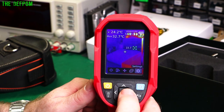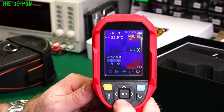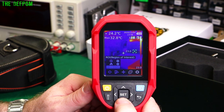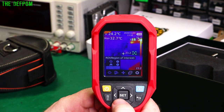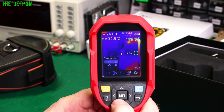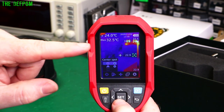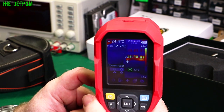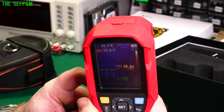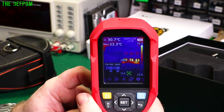With the center spot turned on I can focus on something — for example, pointing at the clock up here it tells me that temperature. It's really about 30 to 31 degrees C up there, around 30.7. Then there are color palettes — you have about 7 palettes to choose from. I quite like the iron palette, which is probably the best for average temperature scaling as it gives a bit more sensitivity in the visual aspect.